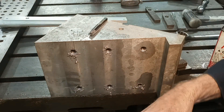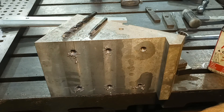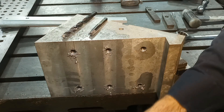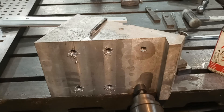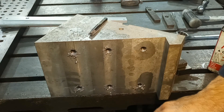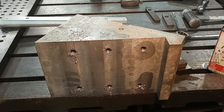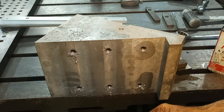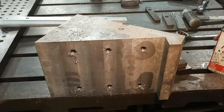This hole is going to be tricky because my clamp is straight behind it and I can't go through the hole very far without crashing into the clamp, so when I get to tapping I may stop a little short and finish that one after. I'm shifting between high and low range for tapping versus drilling — another sign I'm not a lifelong boring mill operator, as I forget to shift about half the time.